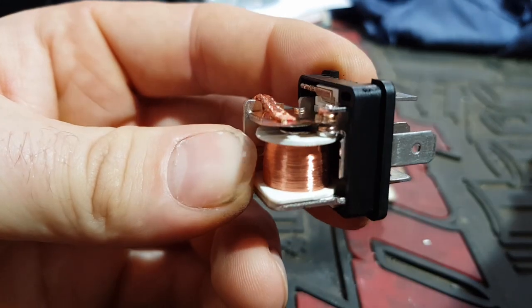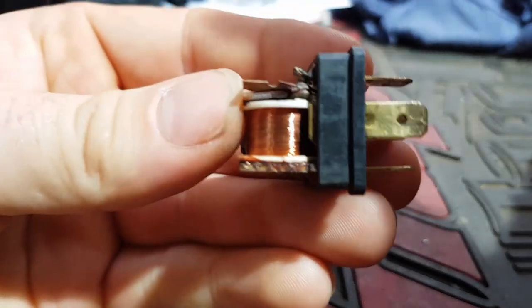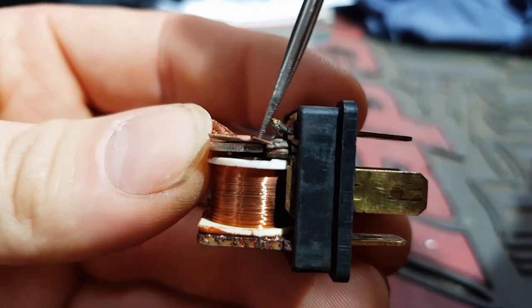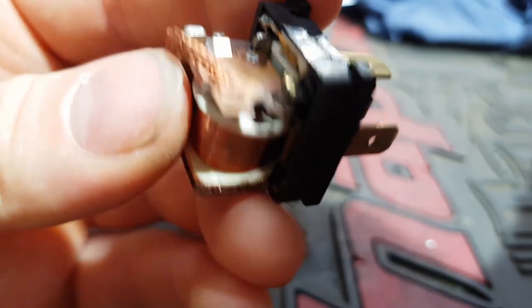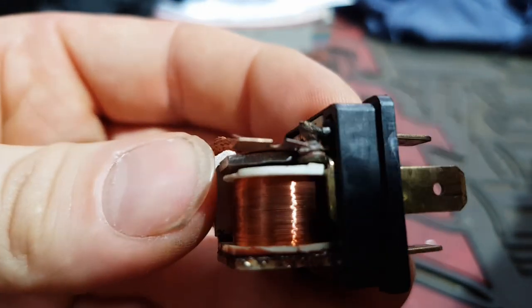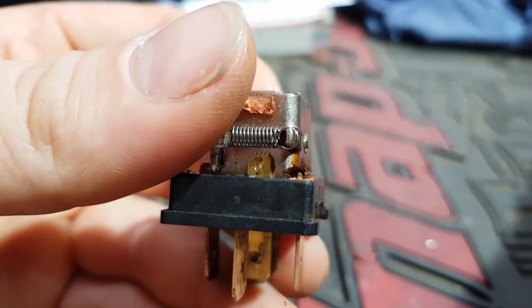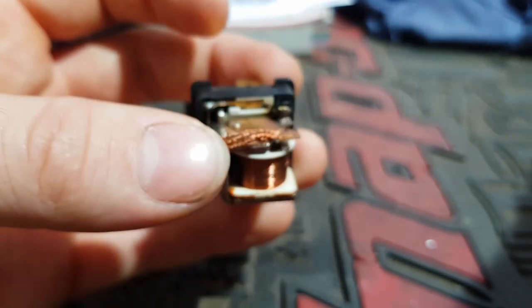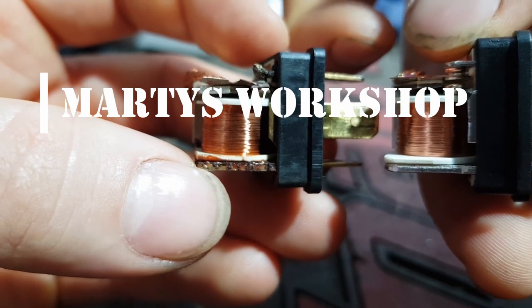As you can see on the new one, it's nice and firm with a lovely click action — that's how it should be. Mine has seen better days. As you can see, it's completely melted, and the contact from the heat has started to bend away from the plate — it's actually melted a circle into the plate as well. This is the first time I've ever seen this happen, which I thought was quite interesting. You can see some corrosion inside, and I think that's what happened — the connections got corroded, got hot, and melted. I hope you enjoyed this video and got some insight into relays and faulty ones. Please like and subscribe!